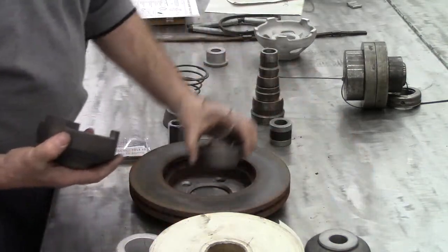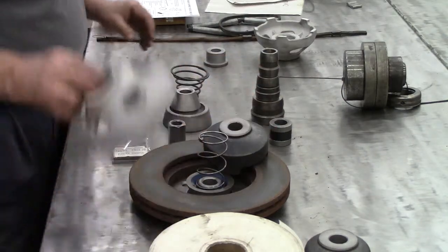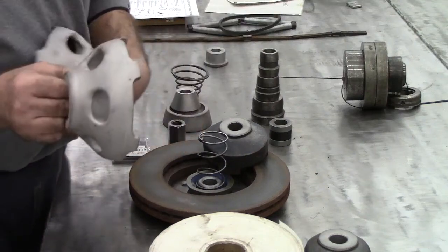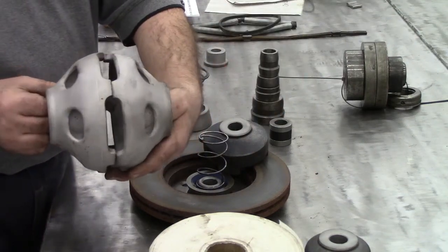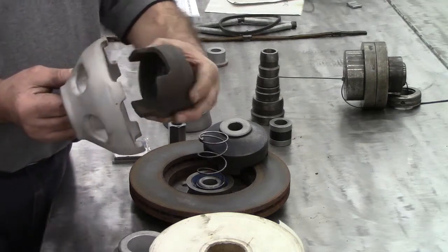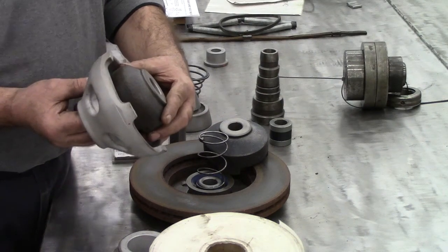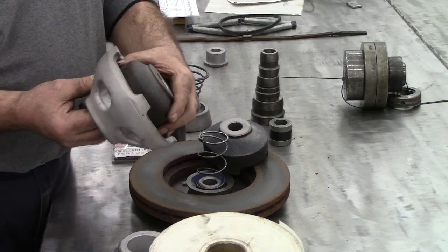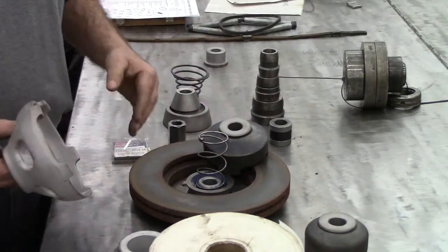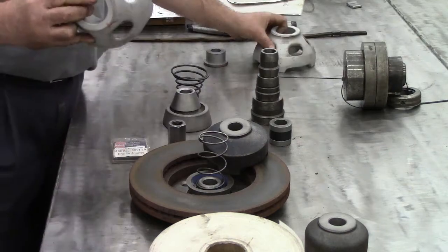So we've selected the taper, the spring, and the hubless adapter. Along with these two aluminum ones, it's always a great idea to have them of about the same diameter — one on the inside of the rotor and one on the outside — so you're pinching the steel evenly. If you use a small one with a large one, you could flex and distort the flange plate, which will put a warp into the rotor. That's why we use a torque wrench on all lug nuts — to avoid distorting the flange, which runs up into the rotor. These floating adapters have a hole bigger than the one-inch arbor.